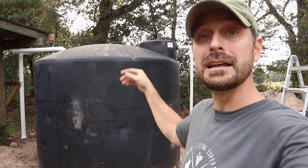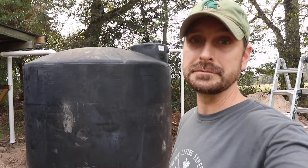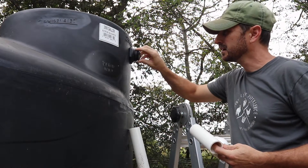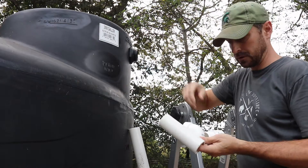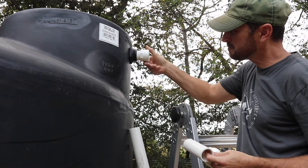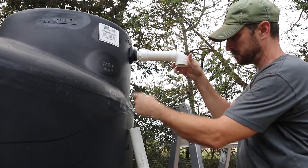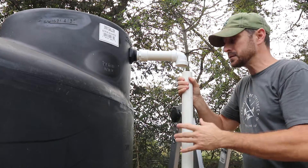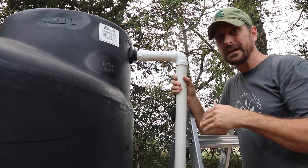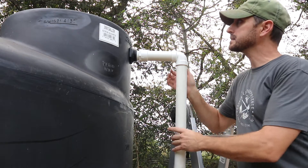We also have the Norwesco 2,500 gallon tank listed in the description below — it's made for rainwater collection. So as always, you want to dry fit before you do anything else. We're going to take the plug out of the bulkhead, thread in the male one and a half inch fitting, then a six inch piece to keep it away from the tank, then a 90 degree elbow, and then a six foot downspout to divert the water down. We'll put a slip fitting with screen over the bottom of the downpipe. Keep everything away from any other connection in your tank because in the future we're going to use the lower bulkhead to connect to another tank.